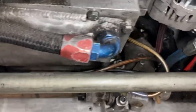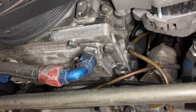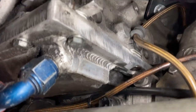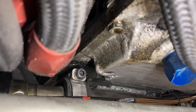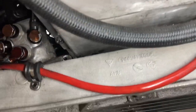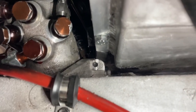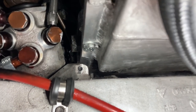I've gone with a dry sump oil pan, which I modified — one by CSX Racing. I had to cut away the oil pan and build up a little notch, a little bridge up there, and that gives me room around the steering rack. You can see the modifications: I had to cut and weld a little step up to allow clearance room for the steering rack. This is a pretty low profile oil pan — there's not much clearance between the cross member and the bottom of the pan. I did have to trim the cross member mounting ears a little bit to clearance it.